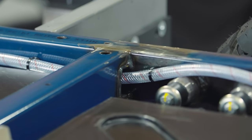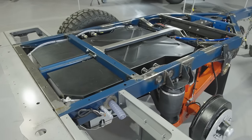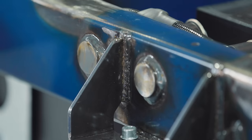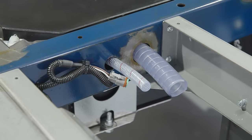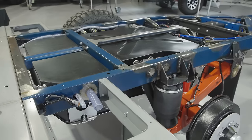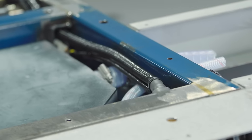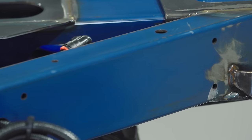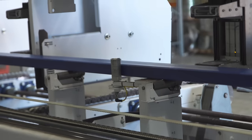The chassis is all steel. The main actual frame is welded, and then we have some sub-components that are structurally riveted or bolted to the main frame. We use a 100x50x3mm RHS section. This product comes in from Australian tube mills and it's actually laser cut by my brother on his rotary axis machine.